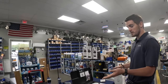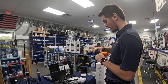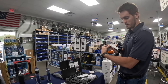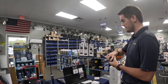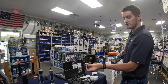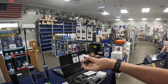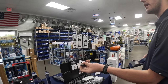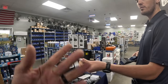We do these testing tunes where you can bring in your leak detector and we check it out. First thing I do is always check the date code on it. This is a 2023 unit — so just this past year — and the sensor is new as well, also 2023. These are brand new units. Before I turn it on, first thing I'll do is look at the filter. I take this cap off — you can see the filter right there; it's nice and white, it's clean.